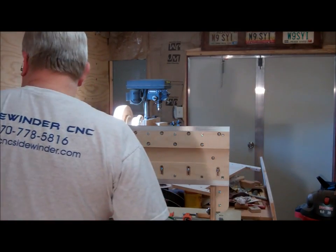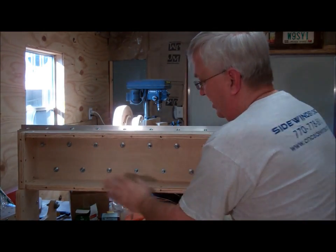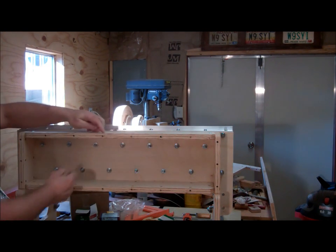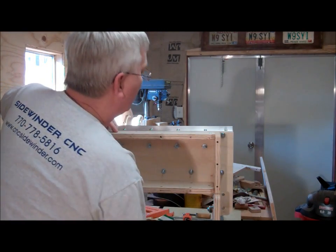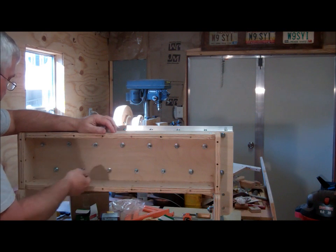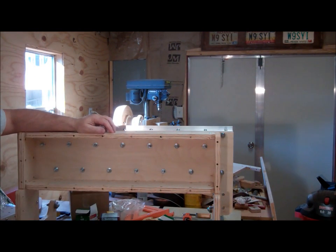Let me turn this around so you can see. This is what I was talking about — when you have the back panel off, you're bolting the rails through here, and then when you put the back panel on you put a dowel nut in here. If you drop it inside there it's just going to rattle around, which would be really annoying. So I'm going to put a hole big enough that one of these dowel nuts can fall through before I put that back panel on.